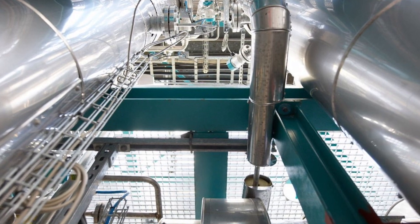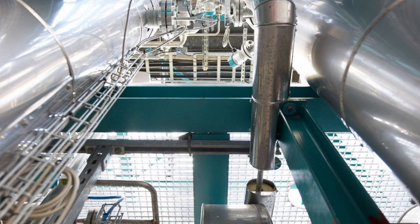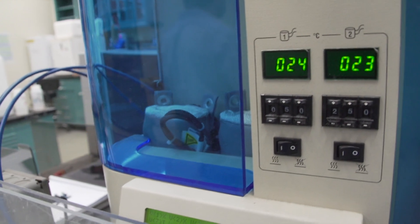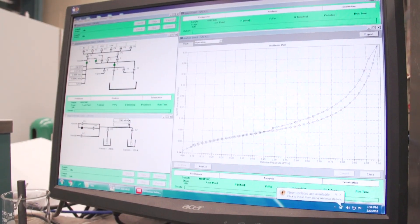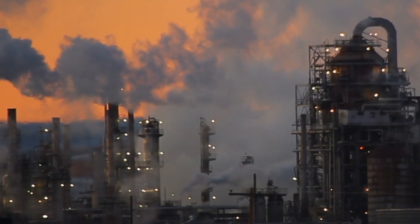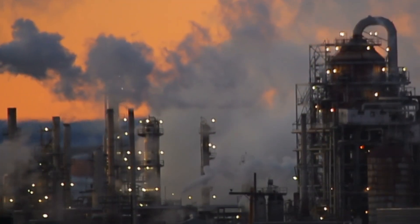There are so-called liquid amine scrubbers out there to do this. However, they are not stable — they decompose over time. They're rather expensive because you need to regenerate those materials, and you need to put a lot of energy into the system to regenerate them.